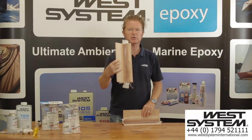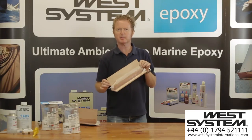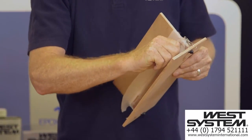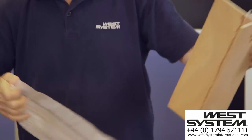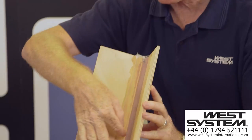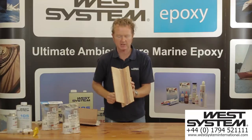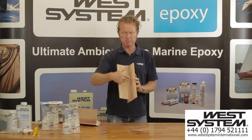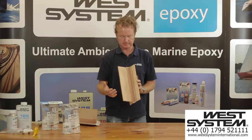Our fantastic fillet joint was peel-plied. And as everybody says in these demonstrations, here is one that I prepared earlier. This is just to illustrate removing the peel ply, which rips away quite nicely. You throw this away, you cannot use it again, but you are left with a very, very nice textured surface underneath, which is totally graded and actually better than sanding. This will give you a more powerful abraded surface than an 80 grit sanded surface.